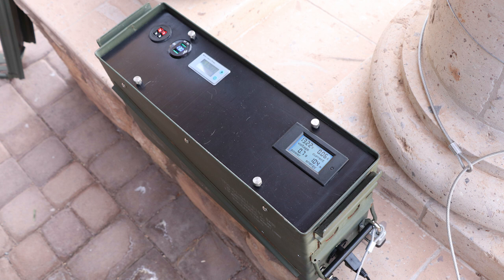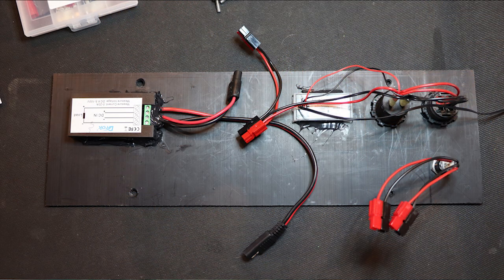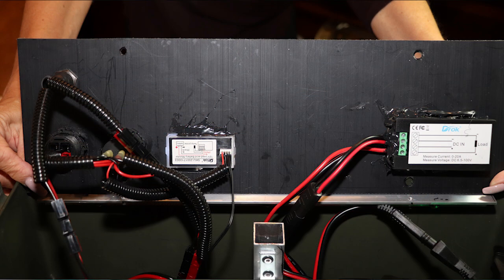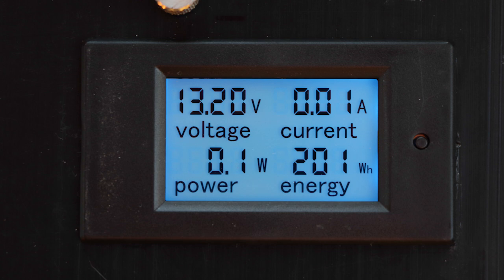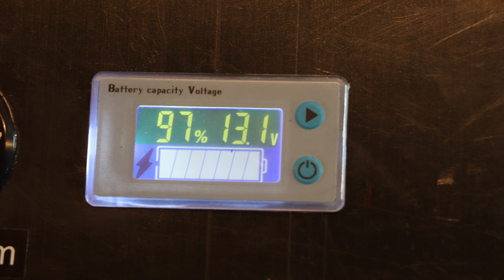Then I started designing the top panel. I was looking for something that would give it a finished look and provide status information so the health of the unit could be monitored. I cut the panel from acetal plastic — it looks good, is easy to work with, resistant to chemicals and abrasion, and reasonably sturdy. After cutting all the necessary holes, I fine-trimmed them to closely fit the components. Using a file or rasp was nearly useless, but carving the edge with a knife was super easy and made really nice edges. I included a digital power meter to show voltage, current, and power from the solar panel, then added a 12V system section with Anderson PowerPole connectors, USB power ports with digital voltmeter, and a digital battery monitor. The battery monitor is very important because running batteries below 50% causes damage that cuts the number of charging cycles before serious degradation. Having a meter that directly shows battery charge percentage is the answer.